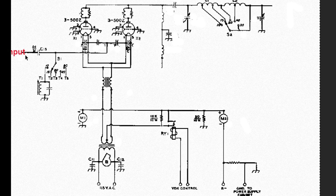Here's where the RF goes in — this would be the coax connector. There would be a relay here connected to the output, so the input could go directly to the antenna and bypass all of the stuff. Also, during transmit, that relay would perform the function of connecting this input to the tubes.